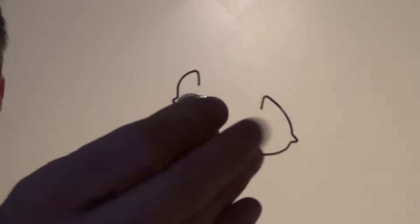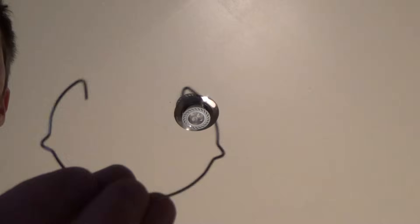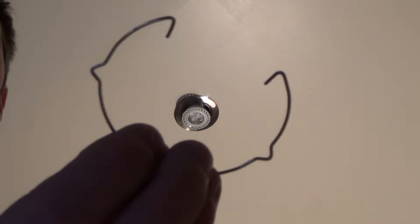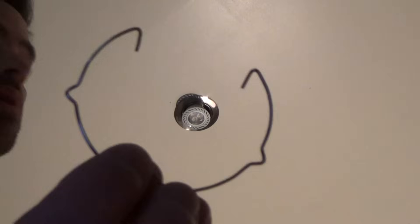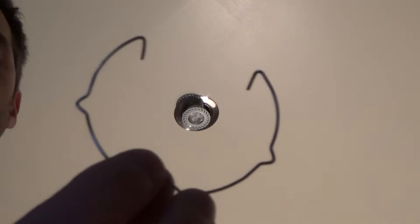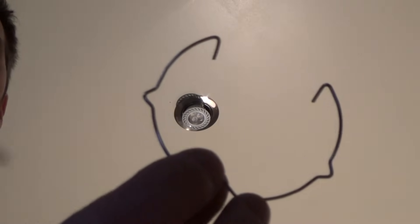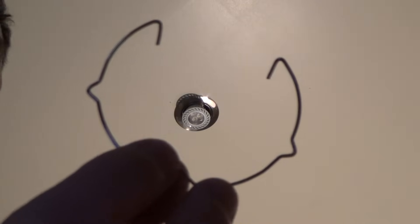Obviously make sure it's cooled down if it's just blown — LEDs don't give off that much heat, but if you're using halogens, don't go anywhere near it for a good 20 minutes until it's cooled down, because they get very, very hot. Always turn off at the light switch. If you're unsure and both have blown, turn off at the main fuse board. Don't take any risks.